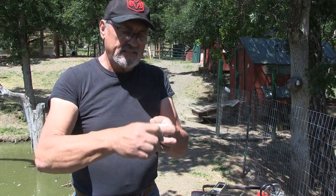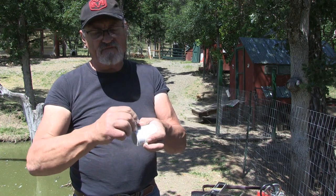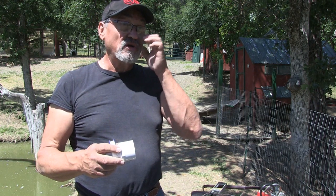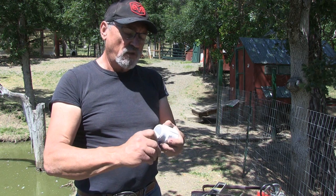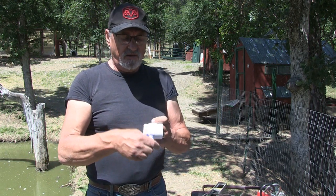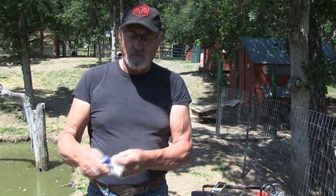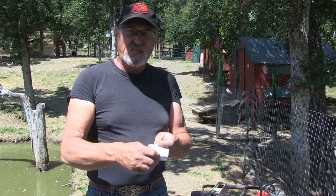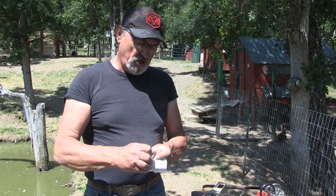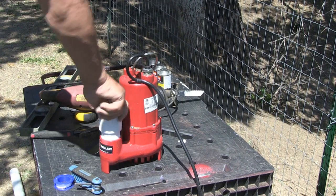And this pump, like I said, it's only a pump. You can just order a pump that you use for a septic system. Some of you guys are lucky to have a percolating gravity feed septic, but those of us who have bad soil, we have to have a sand filter system. So this pressurized pump actually takes the effluent, which is the toilet water, the gray water, urine, and pumps it through the line up into a sand filter through just kind of like this little system here. But it filters all the ick out of it, and then it sends it down a drain field, like your standard drain field. And then it percolates into the ground after that. So that's what this pump is. So we're just going to thread that down.